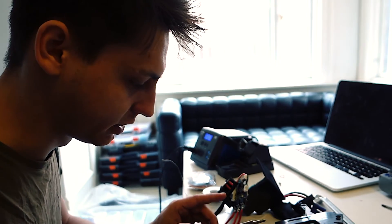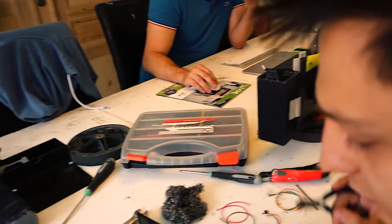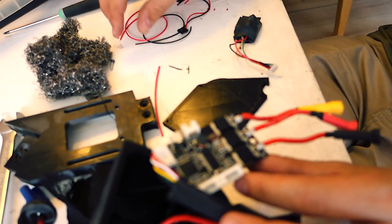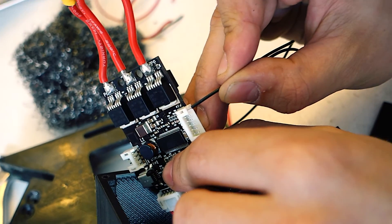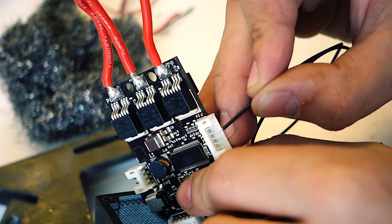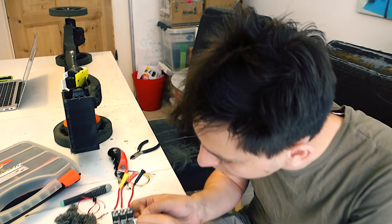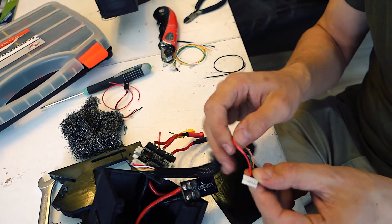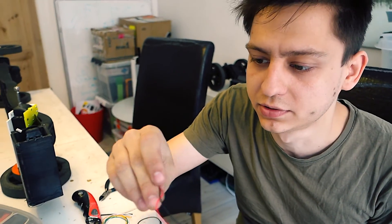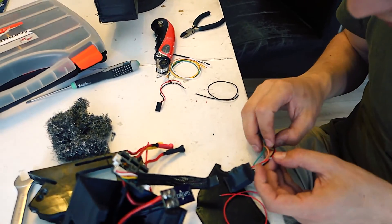What I'm doing now is re-soldering. We need to find another source for ground and 3V, and we found it on this pin connector. We're already using this pin here for RX, and this one for TX — or maybe vice versa. The important thing is: here we have ground, and here we have 3V — the VESC manual calls it VCC, but from measurements it's confirmed to be 3 volts. So I cut out the long cables with the broken pins and wired them into this connector.